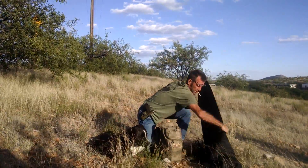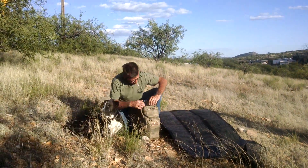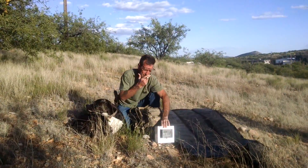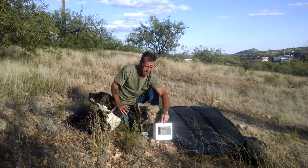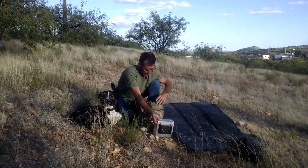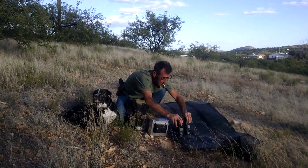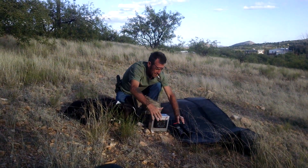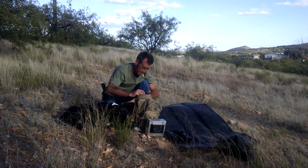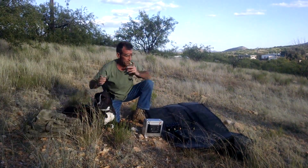What we have here is a 45-watt solar panel — that's how we supply power to a 12-volt, 20 amp-hour battery. On the front of the battery is a solar controller; we plug the solar panel into the controller. The transmit and receive radios are plugged into this as well. The radios draw off the battery while the solar panel charges the battery. This is the duplexer for that, and our antenna — so this is our whole setup.